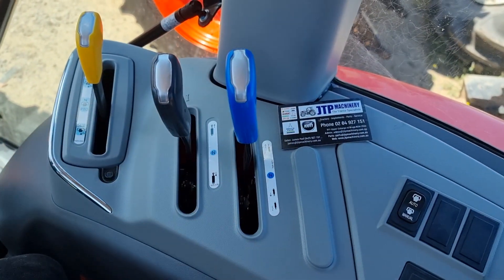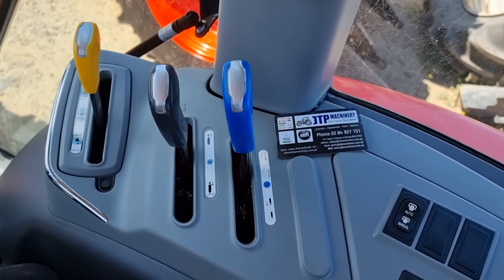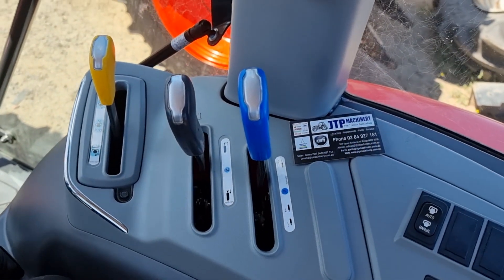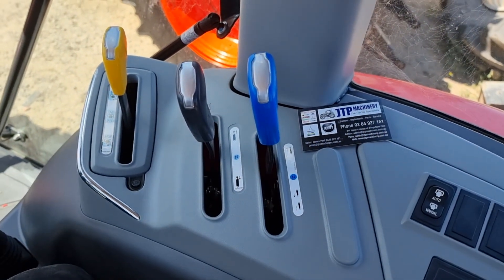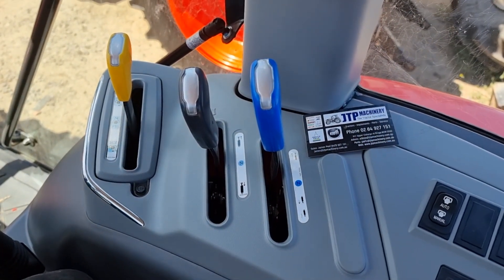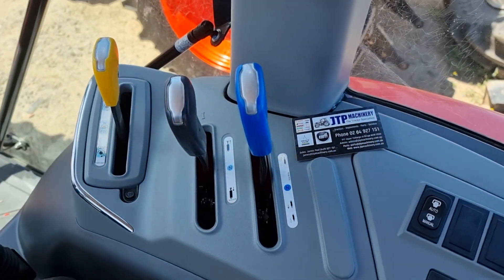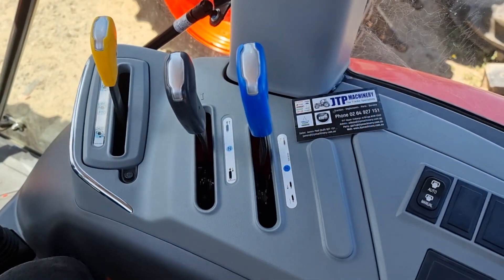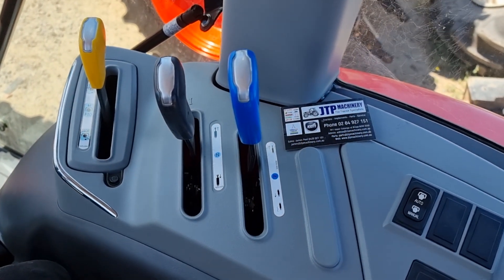It's alright for a minute or a few minutes, but a couple of hours of continuous pressure relief like that and you'll heat the hydraulic oil up red hot and start to damage the hydraulic system. I've seen plenty of brands of tractors over my working career with completely failed hydraulic pumps and hydraulic systems because someone — either inadvertently or intentionally — had the remotes locked on. It only takes a couple of hours, normally around two to three hours, for it to start doing damage.